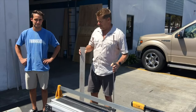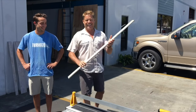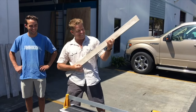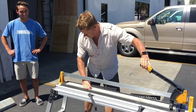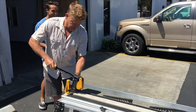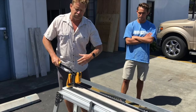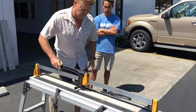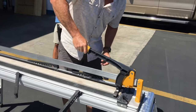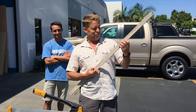A little one cut it in half, along comes master T — we cut it in half. It's about three inches wide. Take the super duper cutter. Remember, you don't have to push too hard — just moderate pressure. Some guys try to push too hard, but just kind of moderate pressure — score the surface totally.